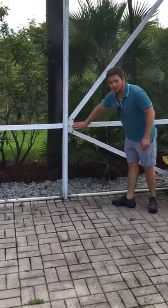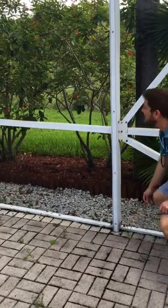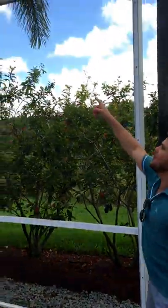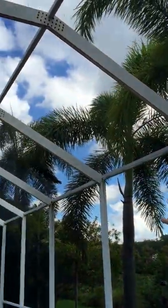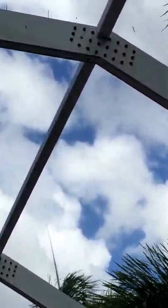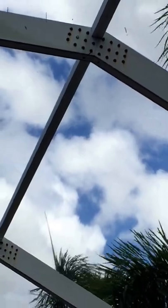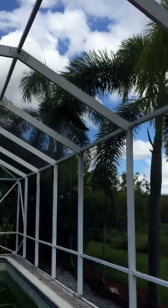Our K-brace plates are much too small, with rusted fasteners throughout. And looking up — this is my favorite — this is our gusset plate connection on our mansard-style roof, and you can see all the fasteners have completely rusted out. This is very typical of cheap imported screws that cost about a penny each to buy, versus a much higher quality product which costs about 10 cents each — but we feel it's worth the extra money.